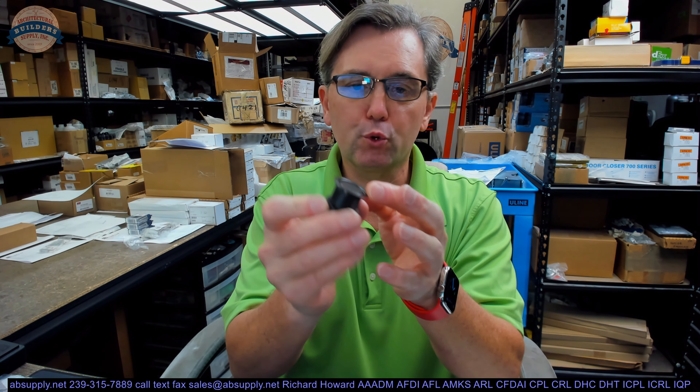So this is a 3910N. The 'N' means no faceplate — in the sense that this small little perimeter trim is in lieu of a large rectangular faceplate. Those large rectangular faceplates would be used when you are installing the material down into a wood floor or some sort of surface where you might be mortising, or you are going to apply the strike right on top. Really, when you don't have a threshold is when you use a rectangular faceplate.